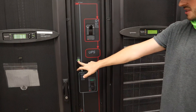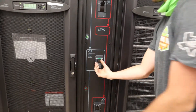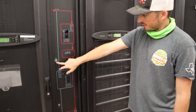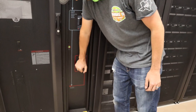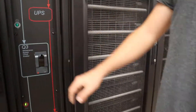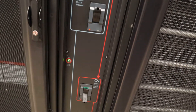Once we did that, the OK to operate light on Q3 has illuminated, so we close in Q3. Once Q3 is closed, the light turned on for Q2. Turn off Q2 — the OK to operate light just went off for Q3, still on for Q2.